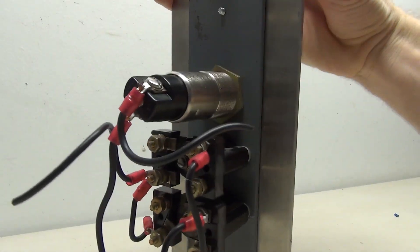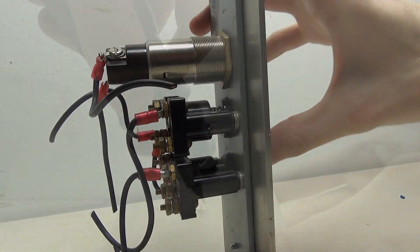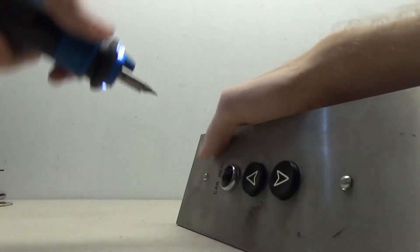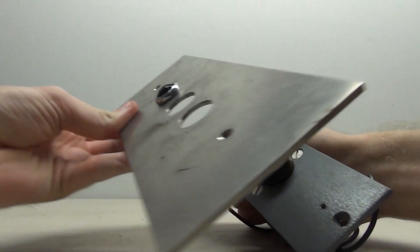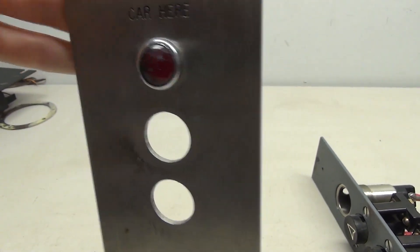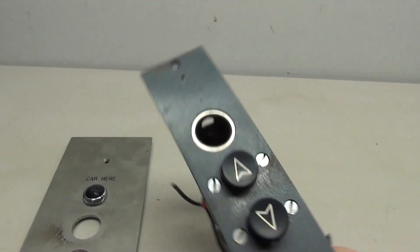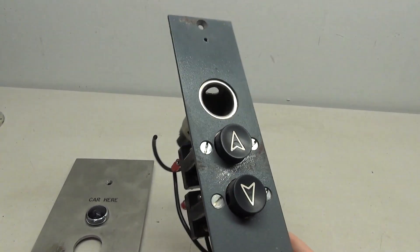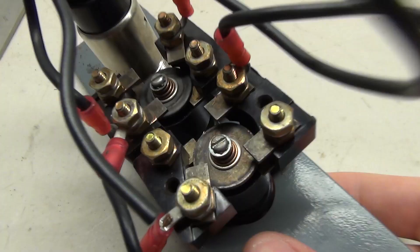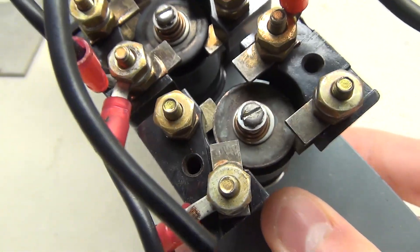Turning the button around reveals the contacts and the lamp holder. The plate for this particular piece is held on with a couple of screws, and once those screws are taken out, I can remove the plate. The jewel lamp is attached to the plate itself — you'll see there's just the holes and the red light. On the button portion, you'll notice there is the spot for the lamp, the two buttons, and how they work. If you've never seen a Montgomery black button before, this is how they work — it's simply just this little disc and when you push the button in, it completes the circuit.